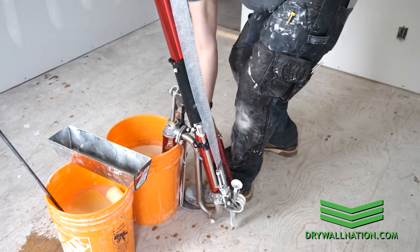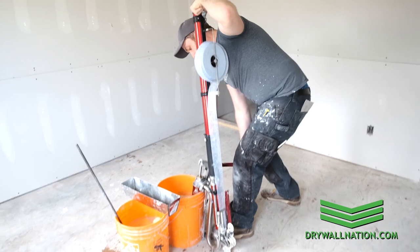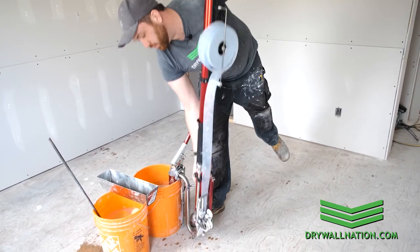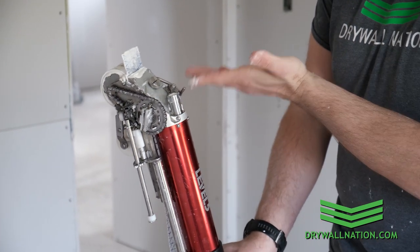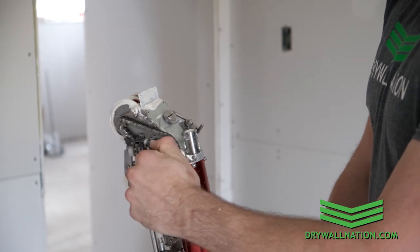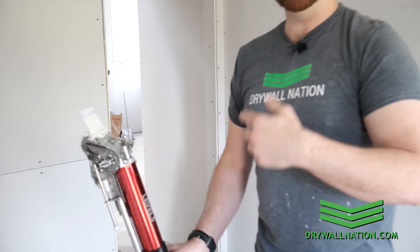So I'm going to pump this up. I've got my fingers at the top here so I can tell when the plunger is going to reach the top. And there we are, just about full — we don't want to overfill. Now I'm going to re-engage our drive mechanism. I'm going to pull down on the cutter sleeve to cut myself a new length of tape, then raise my cutting sleeve and you can see it advances the tape. There's no mud there, so I'm going to manually feed the drive mechanism while raising the tape with the cutter sleeve to advance a little bit of mud onto the tape, and now we're ready to take that to the wall.